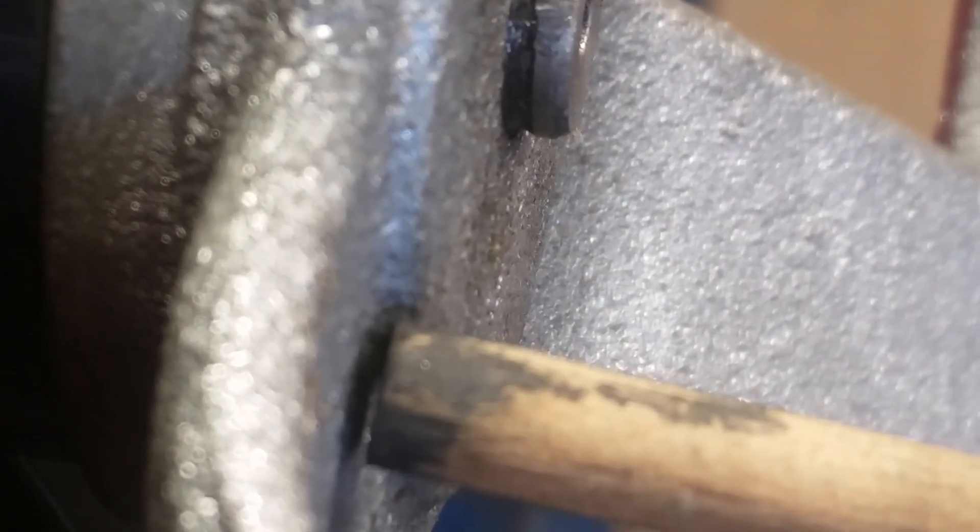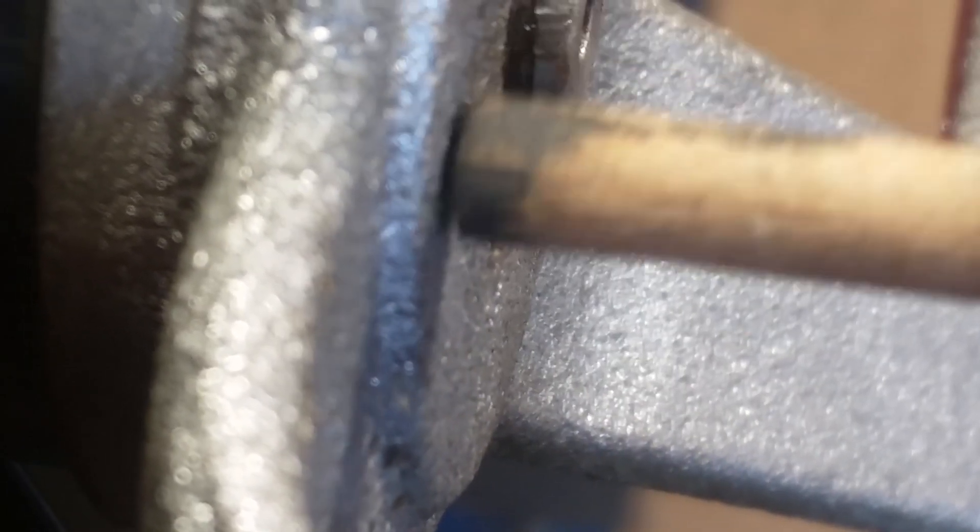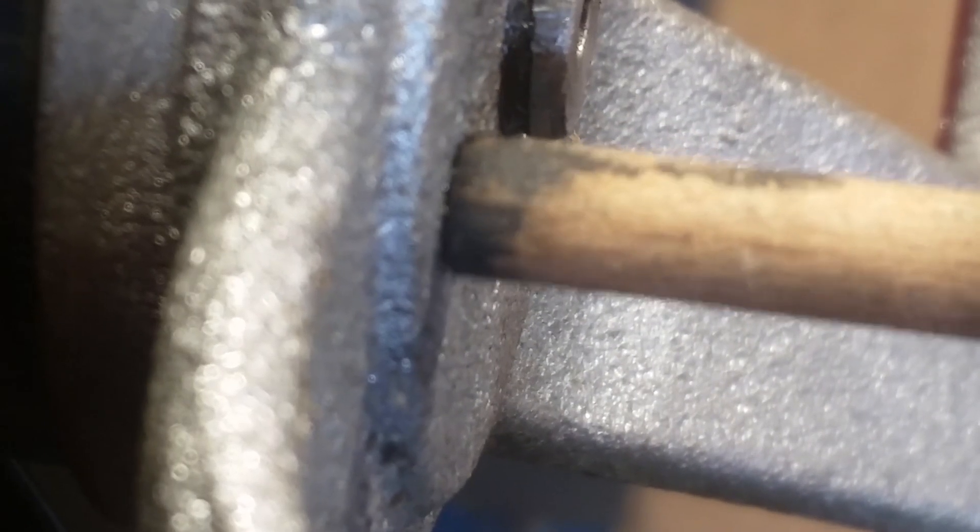What I can see is the snap ring itself — just to give it a bit more stability, that boss here, that very slight raised boss, looks to me to be about a millimetre, millimetre and a half maybe. So what I'm going to do — actually hopefully two millimetres — is mill that off flat, and then hopefully that will give me room for a washer and still clear the cogs.